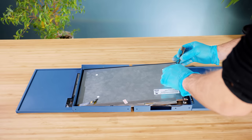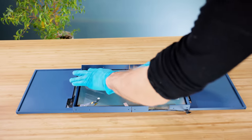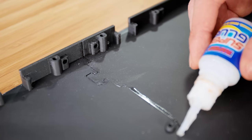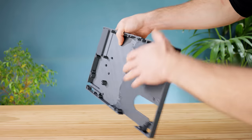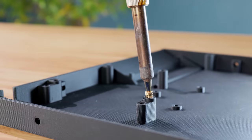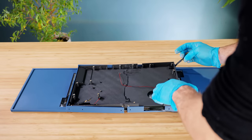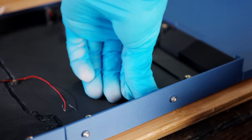It's a bit flimsy right now due to it being in two halves, but that's okay as the next component — the main back panel — should add a lot of strength. This too has been printed in two halves, but after clipping and gluing it together with superglue it's surprisingly solid. This back panel has a plethora of mounting holes and supports for the various components, and they're intended to be used with some little threaded inserts which can be added with a hot soldering iron. These are required on the sides as well for screwing to the main screen frame, which gives it its required rigidity.